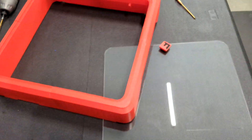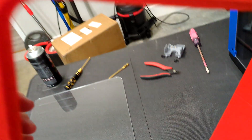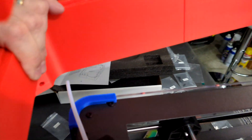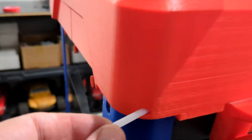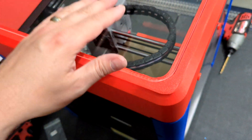I've already assembled it but you'll need to snap all your pieces together for the riser. You're going to need to super glue in all the magnets — there's a whole bunch of them, it's a little fiddly and a pain. I also went ahead and drilled the Bowden tube hole out a little bit. When you go to put this on, you slip the Bowden tube right into there and it comes out right here. Then you take the top and put it on. This is the reason we all like this riser so much — it makes it so the Bowden tube and wiring don't run into the top of the printer.